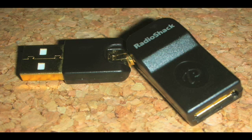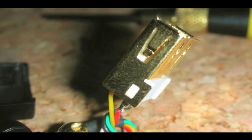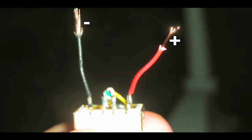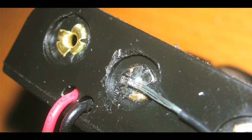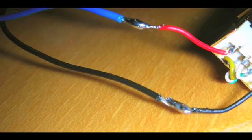Now we need a female USB connector to hook up to the batteries. You can get this from an old motherboard, USB hub, or in our case, a USB adapter. We only need the black and red wires attached to the USB port, so you can just tie the rest of the wires in a small bundle. With the battery pack, you can either solder the two power cables to connect to the USB port from the outside of the case or from the inside of it, then solder the other end to the USB port.